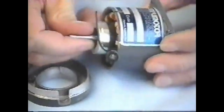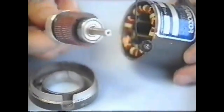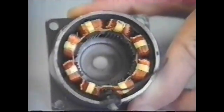To show how the rotor is constructed, we'll remove it from the stator. Since the rotor is magnetized in position, removal causes the motor to permanently lose two-thirds of its magnetic field. The stator has windings and teeth, which give it positioning capability. This small wire is the end cap ground strap. The rotor has a cap over the front bearing, which is spring-loaded by a series of wave washers to allow for rotor end play. This potential for axial motion should be considered in designing systems which include these types of motors.